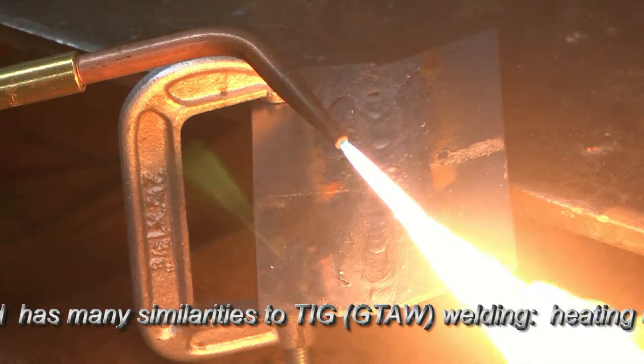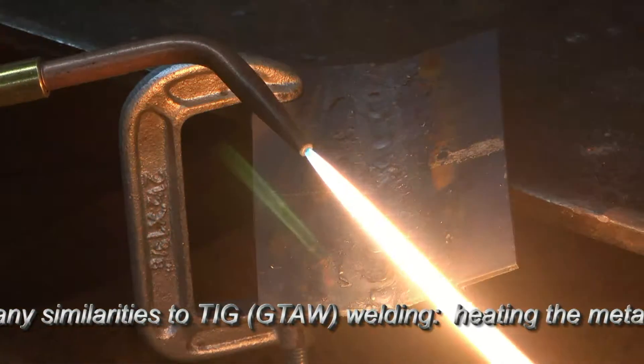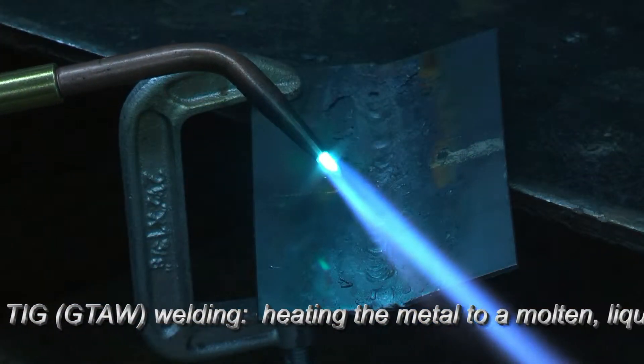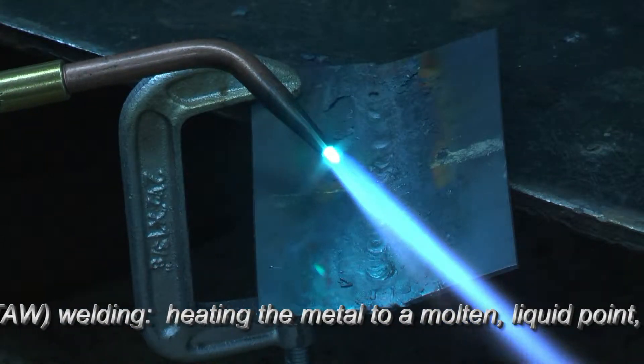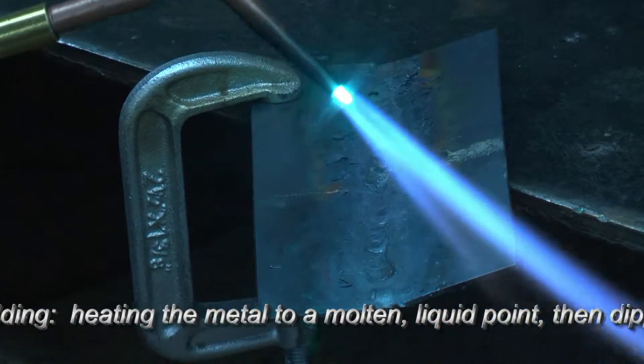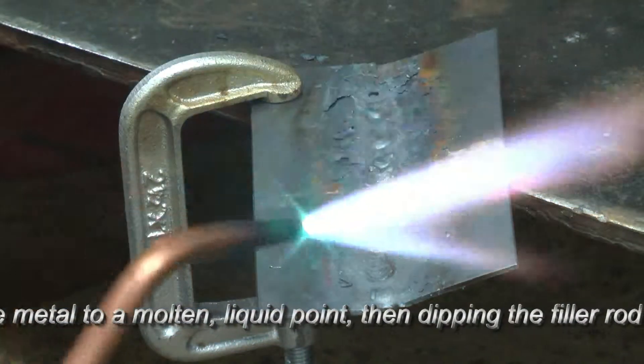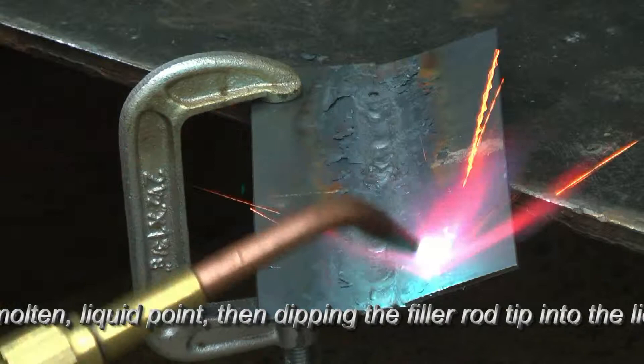For the purpose of a flame, we want to take the torch out a bit and then bring the flame in with the oxygen until we have a nice cone. It's a lot of heat — plenty. We want to resist having this pop back or flash back, so let's not get too carried away with the heat.